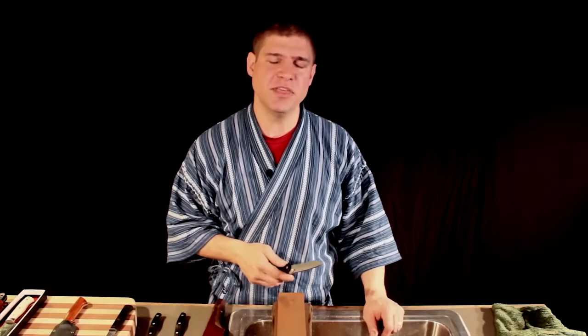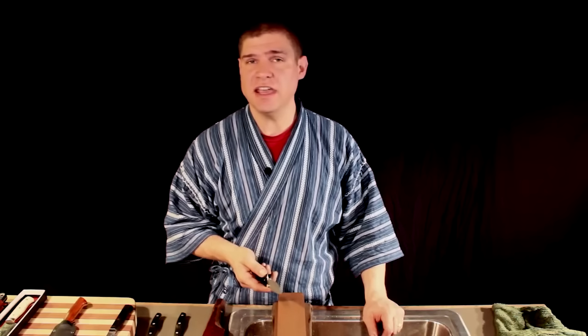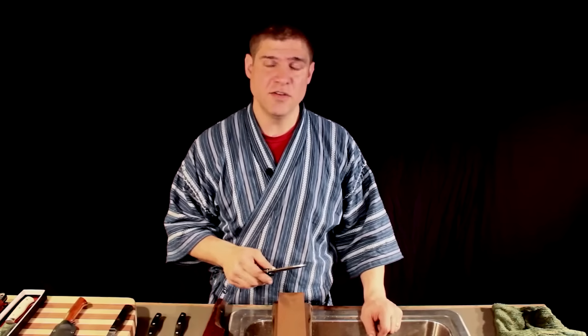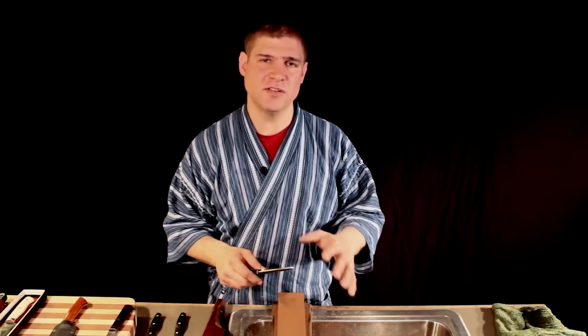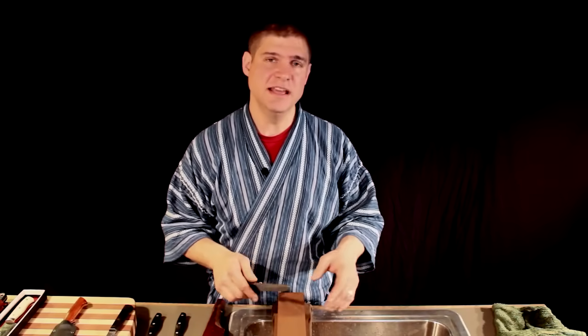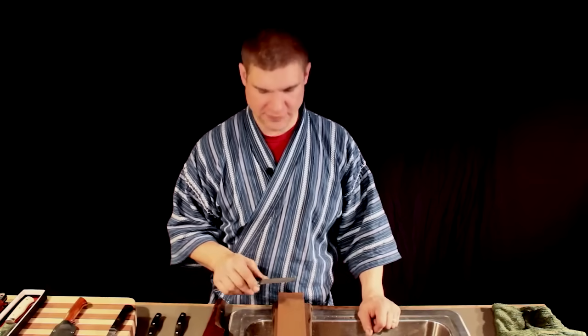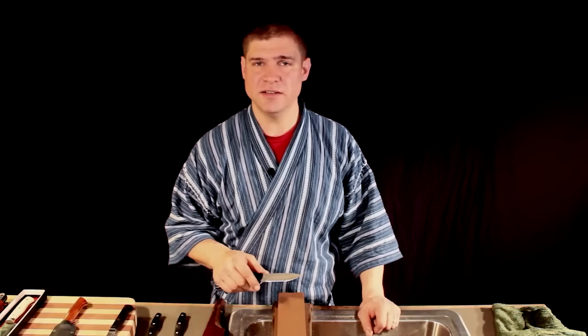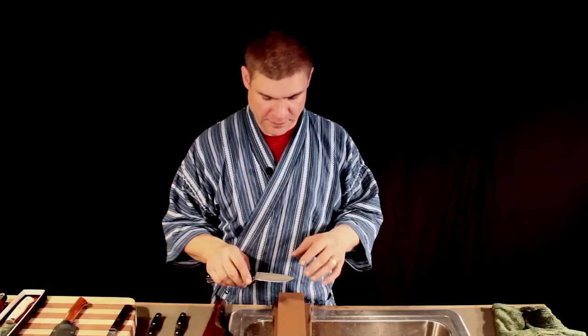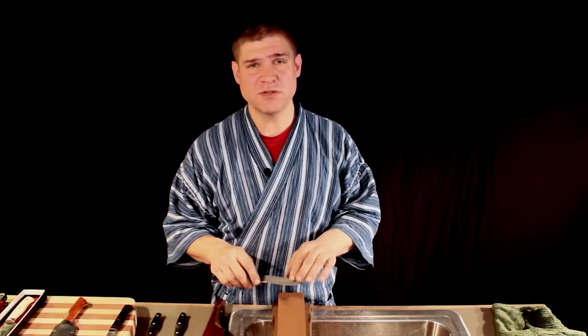Well, a lot of people think so. The unfortunate thing is that if this knife isn't cutting perfectly the way you've got it, the only way to improve its performance is to grind the blade thinner and to grind a new primary edge on it, to get it razor sharp and to get it so it'll cut through things well. So unfortunately, it's a little stigma that you're going to have to overcome by putting scratches on the blade.